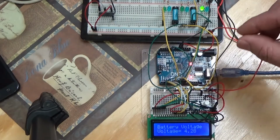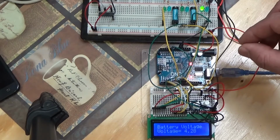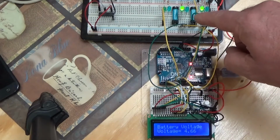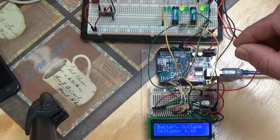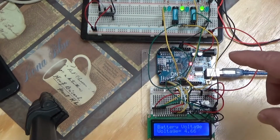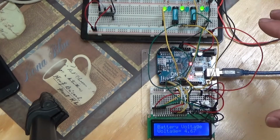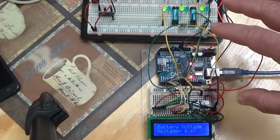We pause, wait for that mining rig to fire up. In this case it's 10 seconds. Real world it's going to be 2 minutes. And we check the voltage and we say, okay, we can turn on another mining rig. And we wait for 2 minutes for that to boot up and start mining. We're going to check the voltage again, and the third rig turns on. We still have enough power and everything's good. Voltage is all good, all the rigs are mining.